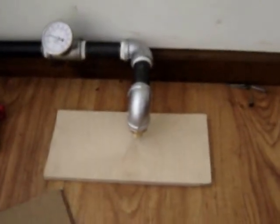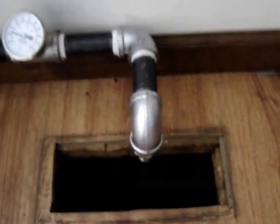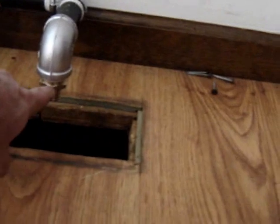This is another vent — I took it out. Since this is a temporary install, these radiators don't really fit under the window like they should, but these are the ones I have, so that's what we're using for now. It is 10 degrees out and windy. I took the one vent out and I'm going from threaded pipe to PEX.